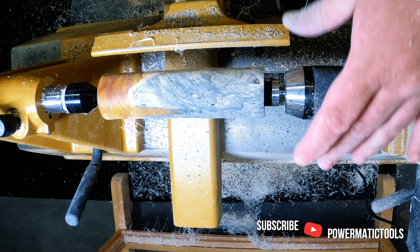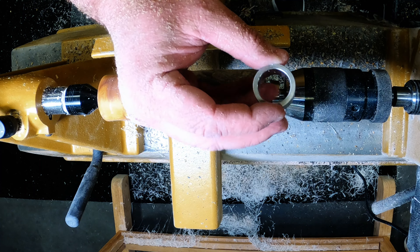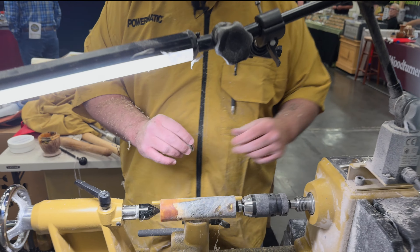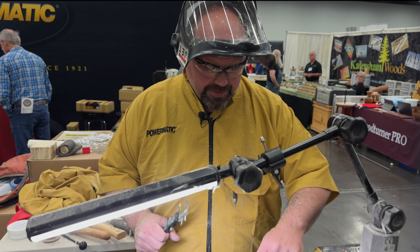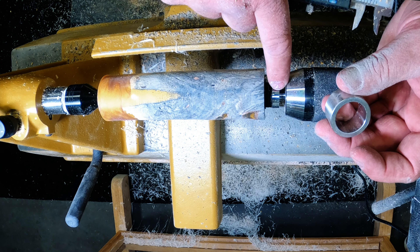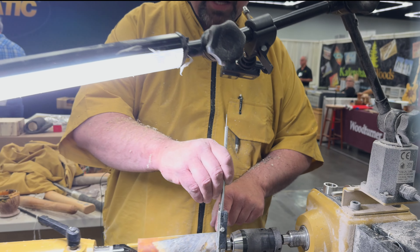Now we've got a round blank — it's time to lay this out. The most important part is we've got to set the dimension. This is the bushing from the kit that goes right over the scoop end. We've got to make sure we match this diameter on the blank so when we slide it over, it slides right in. We're going to use calipers. Now it makes sense why I put that little spacer bushing in there — my mandrel's diameter is bigger than the inside diameter of the bushing, so my parting tool would contact the steel mandrel. I'll use that spacer as a sacrificial bushing. We're just going to come in with a parting tool and nibble away until we get that dimension.